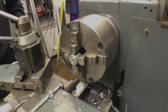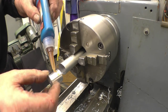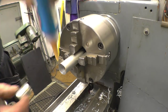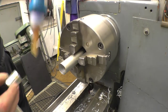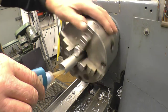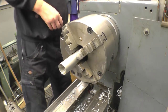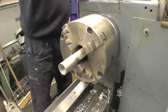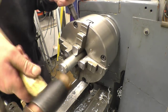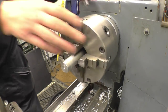I've got some nice threads in there. And I've got some bearing grade locking compound here, which is designed for locking bearings in. It'll lock this in exactly the same. It'll take a lot just to get it spread around nicely. And then hopefully that should just be a nice fit. Hey, that's going nowhere at all. Even without the Loctite, that would go nowhere.